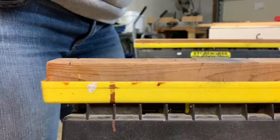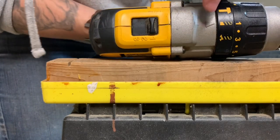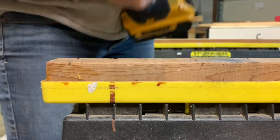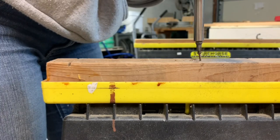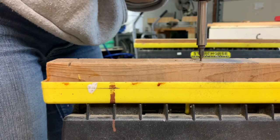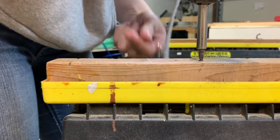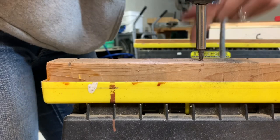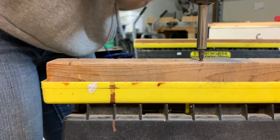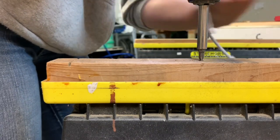If trigger control is an issue, or if you're just getting used to the drill, the solution is to turn your settings down. Especially for something this tiny — take it all the way down to one and one, and your drill will go much slower. Some drills will stop themselves completely when they meet resistance. Mine doesn't, but you can hear it slow down significantly, and that's a good indicator that your screw is tight and it's time to let off the trigger.